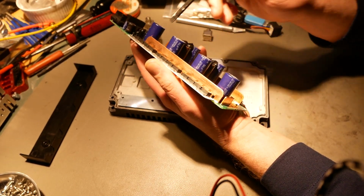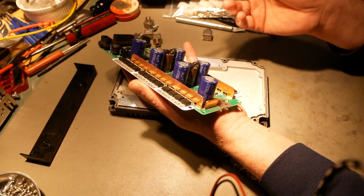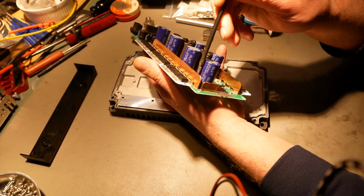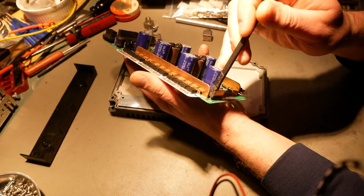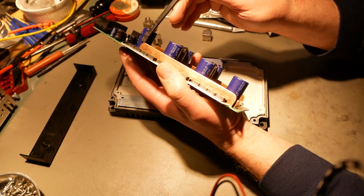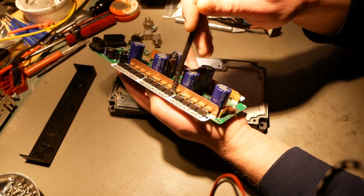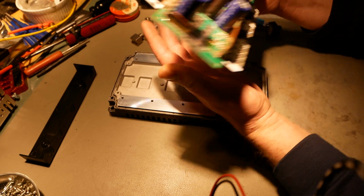This one piece is probably more copper than everything that's used for reinforcing an entire KO Pro or F-Spec controller. One thing I don't like about battery plus is this little gap. Why they didn't just make this an L, I don't know. But yeah, they should have. That would make this a little bit better. But still, that's still a big giant honking piece of copper, custom cut specifically for current carrying for the entire battery plus bus.